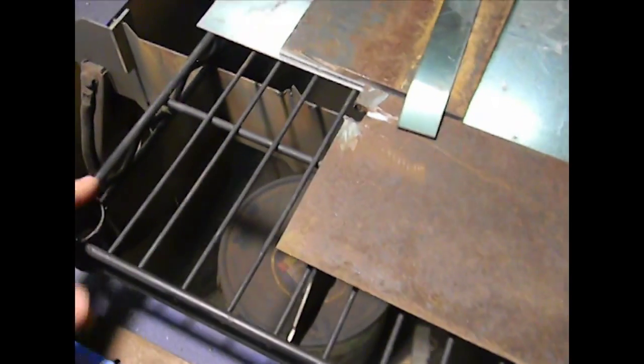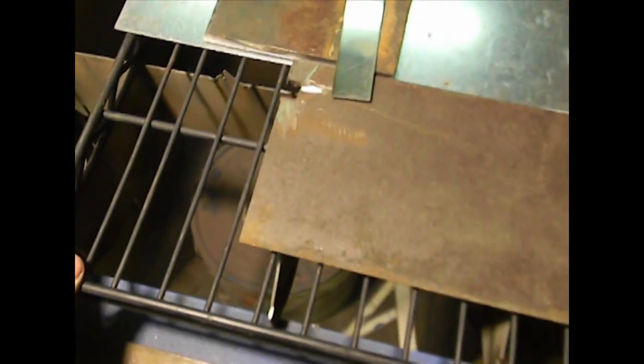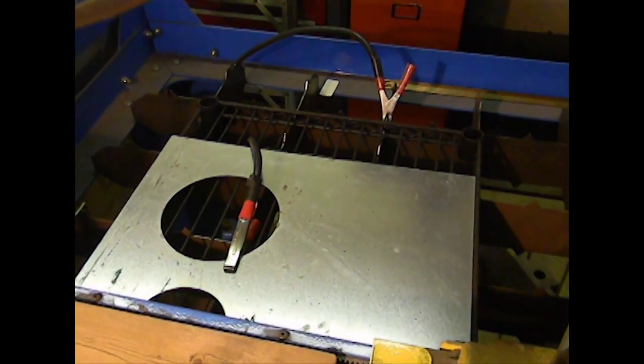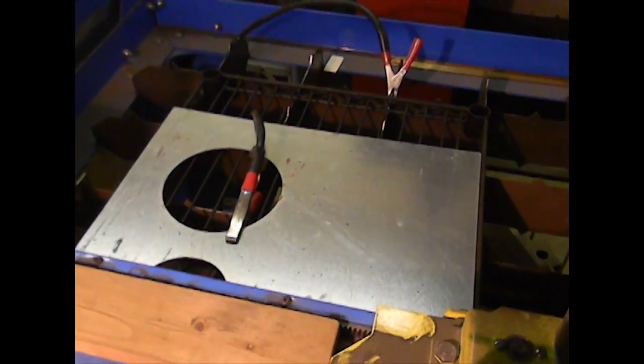Now, this particular shelf isn't stainless steel — it's got some kind of coating on it, which basically means I don't have any kind of ground. So what I did is I took a piece of regular scrap metal that I've cut some circles out of in the past, just a piece of material around the shop, and I have a jumper cable back there to serve as a ground. So now I've got a grounded work surface.